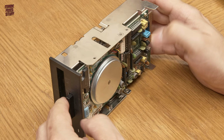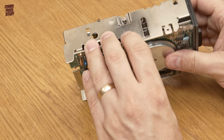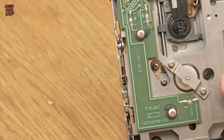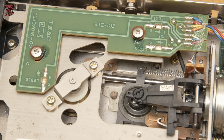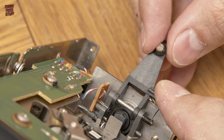Even with the disc out, the drive can't settle to an insertion-ready position, with the mech being jammed higher on one side than the other. In my experience, bending these back never works properly. The missing felt pad was meant to protect the disc and head from physical shocks. We find the pad rolling around in the dust, but let's try popping it back on anyway. You know, just for giggles.